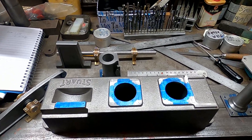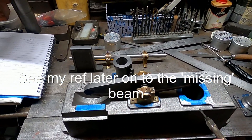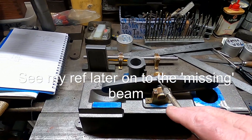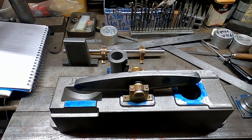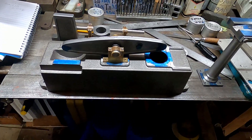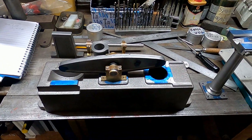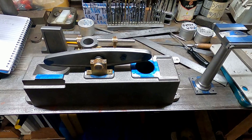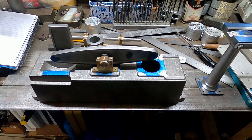It's interesting that the dimensions on the beam, which is seven inches, are not identical - one half is three and a half inches and the other end is, according to the drawing, three and seven sixteenths, a sixteenth less. I assume that in some fashion mechanically this difference in where the beam holes are would account for the increased mass at one end of the various bits of parallel motion - that would be more typical of a prototype. The mass is so small in this thing I can't think it makes any difference, but anyway, I've stuck to the drawing.